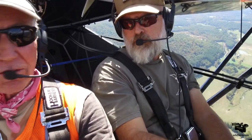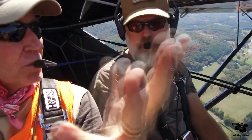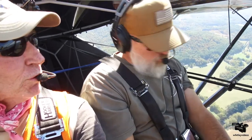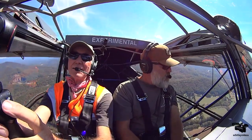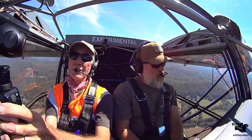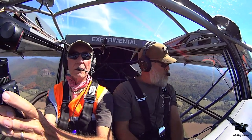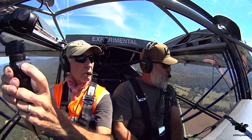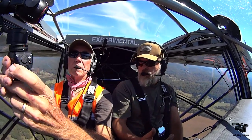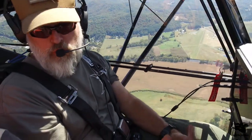Obviously the shaft is turning all the time in the same direction. You're changing pitch, and it's sort of like when you feather a prop, but this goes into a minus feather to give you the thrust in the other direction. Correct. There are some limitations to it. There are three limitations, primarily. One is RPM. It won't go into beta above 1400 RPM. Once I'm in beta, I can go above 1400 RPM to produce more thrust, but I can't transition into beta above 1400 RPM.